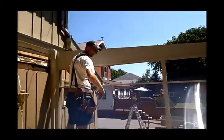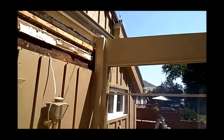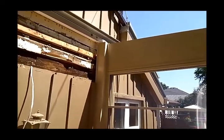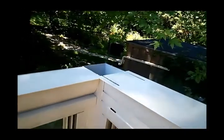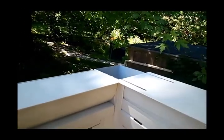So, measuring for the panel cap. The wing panel is cut about 1/2 inch lower than it needs to be. Nice little tricks are things like putting these reliefs just inside the legs with a grinder. That allows us to pinch the panel cap and hide those legs inside the corner post. Makes for a nice finish.